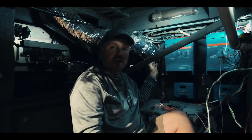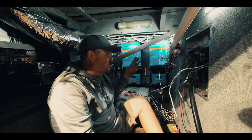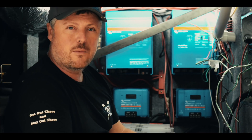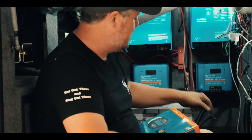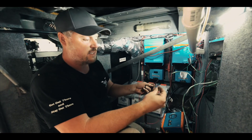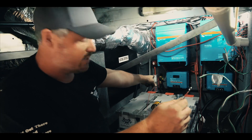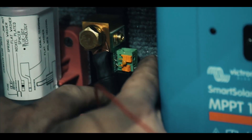I've got both of my 150 amp fuses hooked up to my main fuse panels. Really the only thing left to get power running to all these circuits is to run our ground wires. One of the important parts of our system is this battery monitor. It will install inside the bus and it comes down with what looks like a phone cable and connects into this shunt. The last step in installing the shunt is connecting this power wire to the terminal of our battery and then into the side of the shunt, and then we will be able to monitor all of our battery activity.